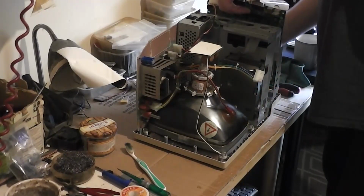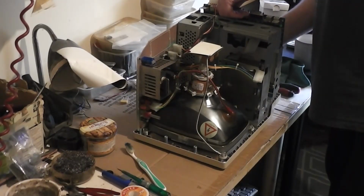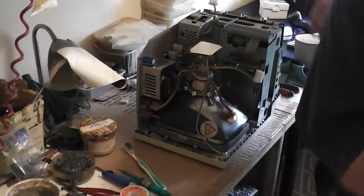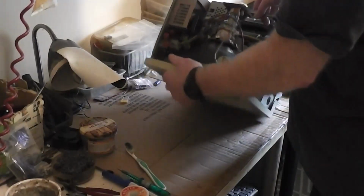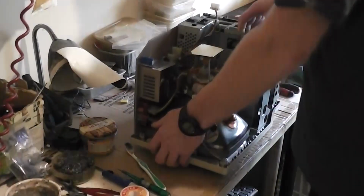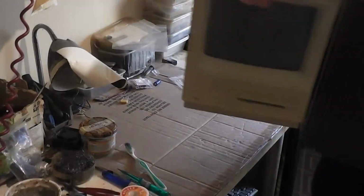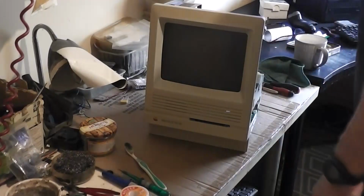But when this board goes in, just checking the sound there. When this goes in, the machine shall detect a logic board and shall send the signal to power up the CRT, the high voltage. And this can be risky. Now, make sure there's nothing under there. There's nothing there, it's just cardboard. We'll leave the screen there so you can see it.